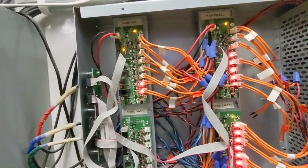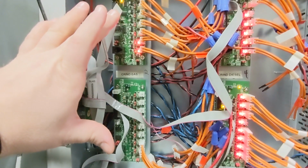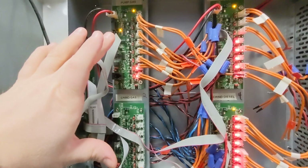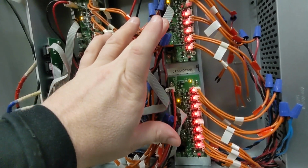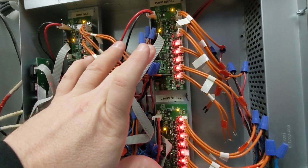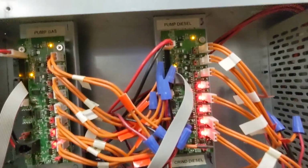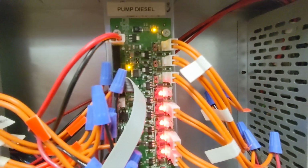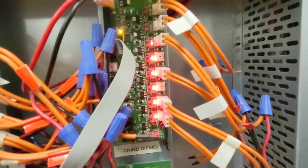All we need on FCI is fuel, as long as you have EMV readers and they're IP addressable on the pumps. Now, the reason that we have 4 boards in here is, like I said, these are capable of doing the first 12 pumps that we have at Hickman here. These 2 are separated because they are controlling the separate diesel island pumps, and there's 3 over there. The one way you can tell that is you see these top 3, how there's kind of a sequence on those blinking lights, and then the rest of these are just solid, meaning they got power.